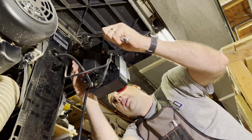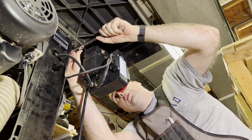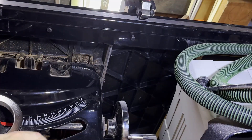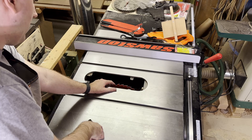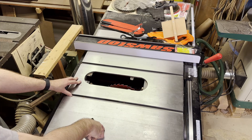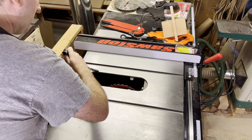With the front bolts loosened, the next ones are in the back — they're actually inside the cabinet, so they're quite difficult to get to. The blade is really in the way here. It'd probably be a good idea to take the blade off, but I'm worried it might end up in a slightly different position when put back and affect the readings. So I'm going to try leaving the blade on. If the bolt is particularly difficult, I'd recommend taking the blade off, or at least putting a cloth over it so it doesn't scrape up your arm.